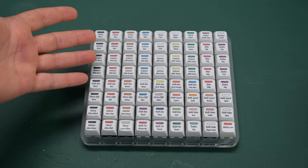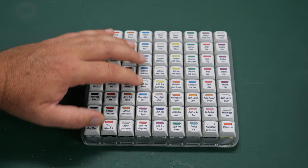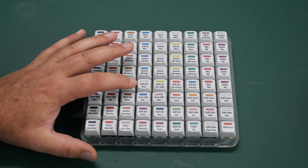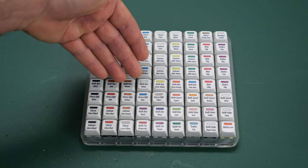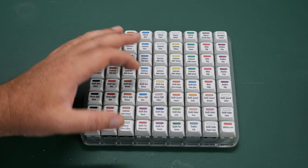That's a high-level overview of the types of key switches available — you can go into more detail online, as there are hundreds of different types. What I was able to do was compare all these clicky keys with the Alps White key switches, and the one that was closest — the one I liked the most — was the Kailh Box White. It emulates both the feel, the noise type, and the tactile bump very, very similarly. Using this methodology, I narrowed down to this as the closest I could get to those retro vintage Alps White switches.